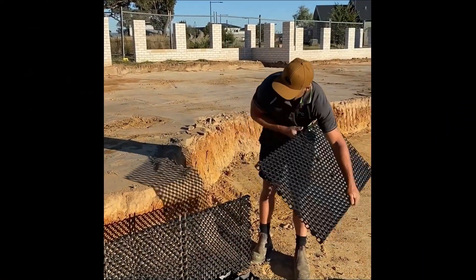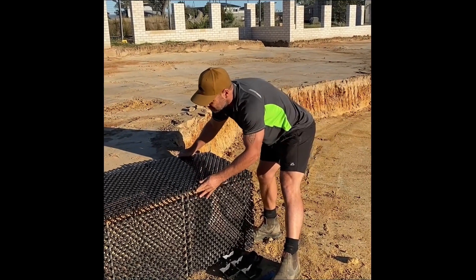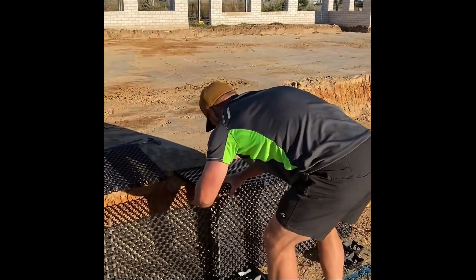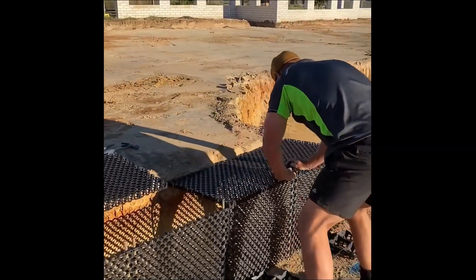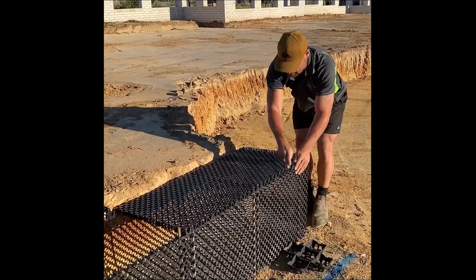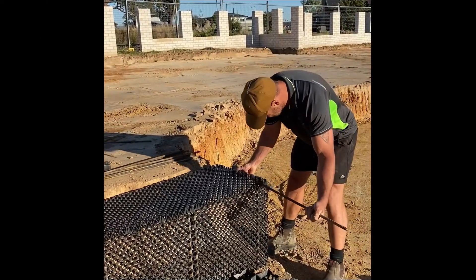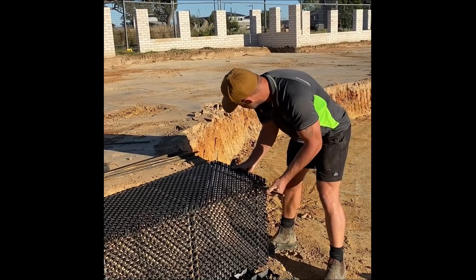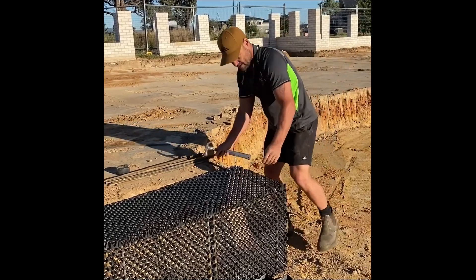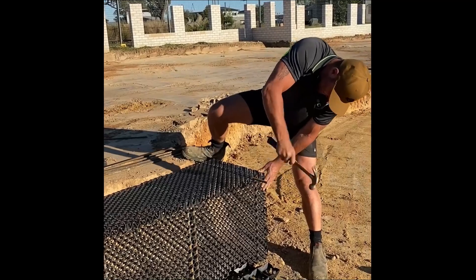The reason why we leave our pins a little bit higher — what we do is we make these sit through these holes. Now we're going to get this measurement here, cut pins, and go from A to B inside here through these holes. It's pretty simple, just get through these holes. Some concreters just leave it on top like that, which is good enough. Or if you can get a bite, I try to get it into the ground myself.